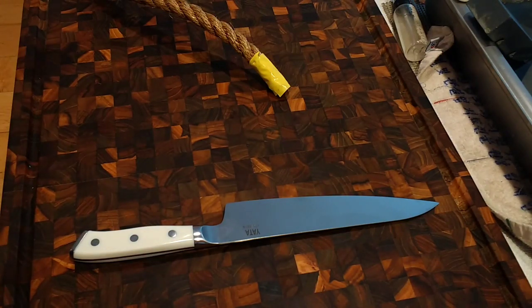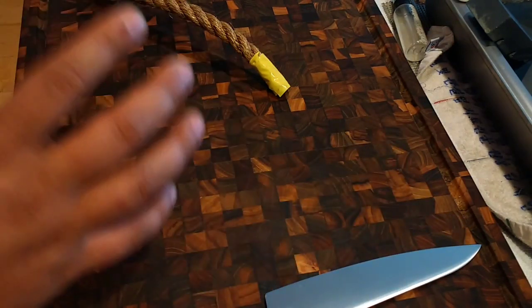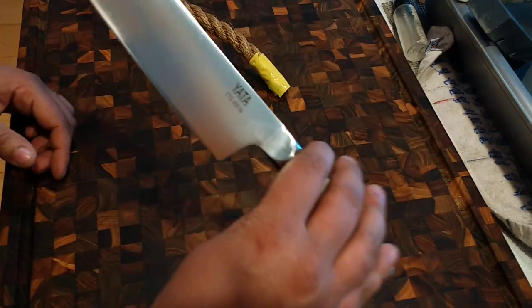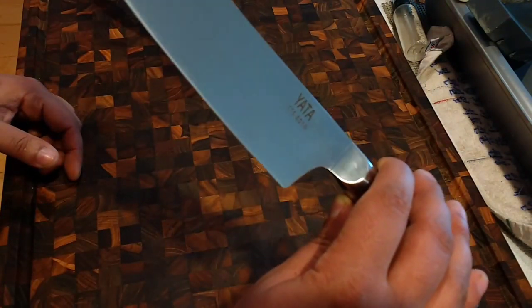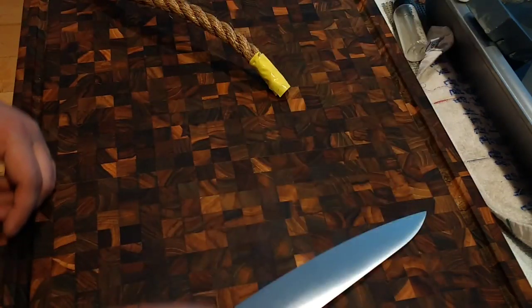So we're going to do a rope cut test with this blade steel. CTS BD1, you know, people, they don't give it any credit because there's nothing special about the alloy. But what's special about this is a CTS BD1N, and it has a much higher working hardness. This blade's actually at 63 HRC. So we're going to go ahead and we're going to do some rope cut testing.